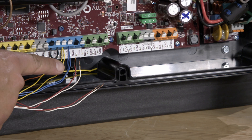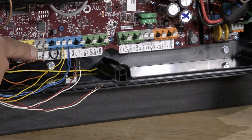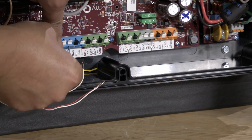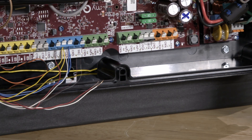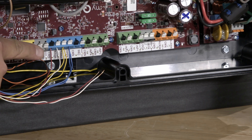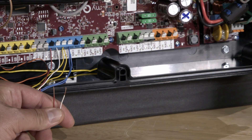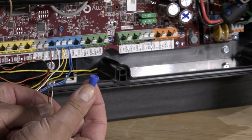The stop circuit will be wired in series. To do this, first remove the jumper in the stop and common terminals on the main board. Then, take the closest three-button station's red wire and the furthest three-button station's white common wire and plug them into the stop and common plugs on the main board. The remaining wall station's stop and common wires can now be twisted together to complete the series.